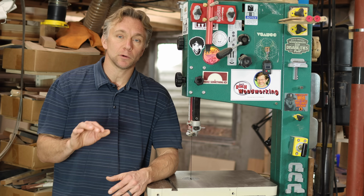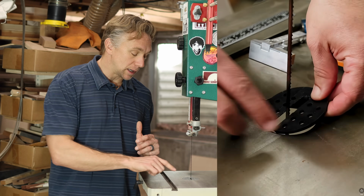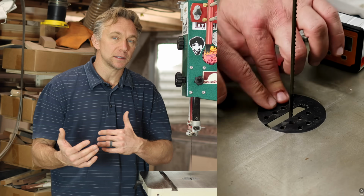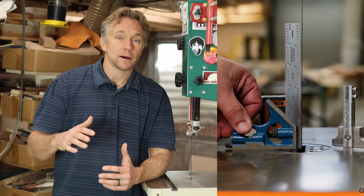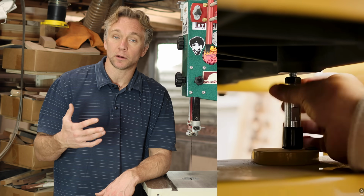I gave him a preview of the video I was going to launch for the blade square, and he mentioned one thing that I didn't talk about, specifically that the throat plate is not perfectly flush with the table, and that makes it even more irritating and possibly inaccurate to use a standard square. So I wanted to mention that, but also give him credit because he's the one that brought it to my attention.